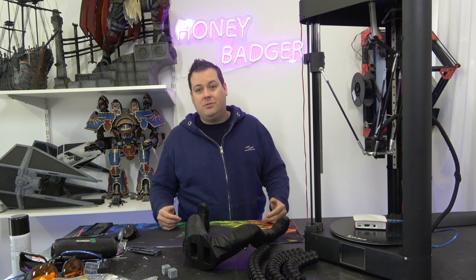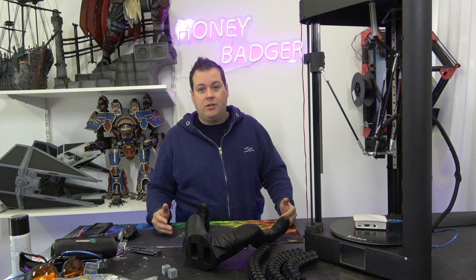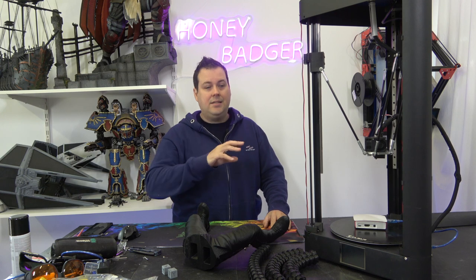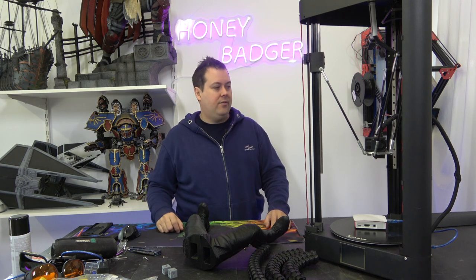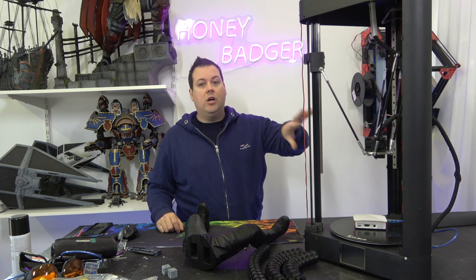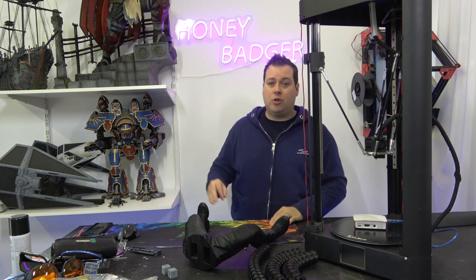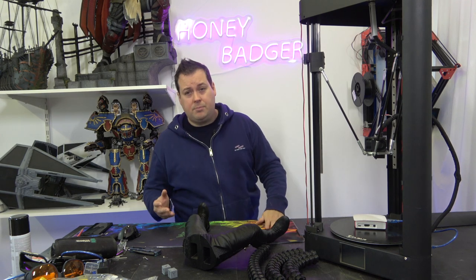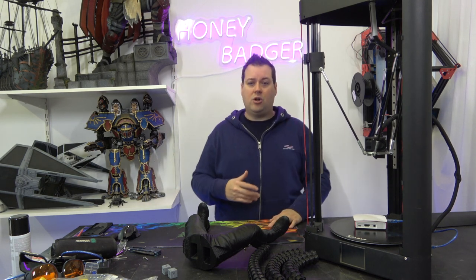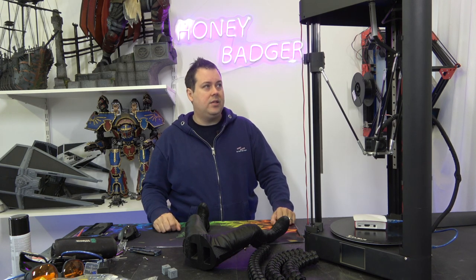Klipper is super easy to use. It's quite an easy upgrade, especially if you've already got compiled firmware and a compiled printer configuration, which we did because it was on Thingiverse. All the bed leveling works in exactly the same way as before. We've got slightly more control over things, things are more editable, it's easier to put things on, and obviously you get the WiFi capabilities.